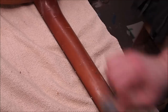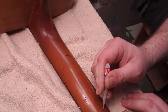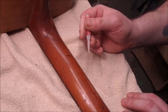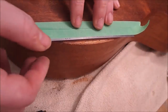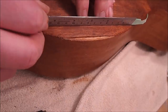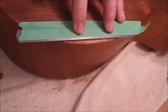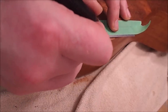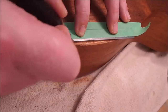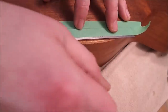This is just 600 grit sandpaper and I'm using very little pressure, just skating over the bad spots. I'm doing super glue drop fills on the worst of the dings - this will take several coats. I hit record and the camera ran out of room on its SD card before I was finished with the operation. Anyway, what I've done here is taped my ruler to the spot where I want it for added insurance, then took a brand new scalpel blade and, striving to maintain perpendicularity with the plane of the top, cut down through the broken section.